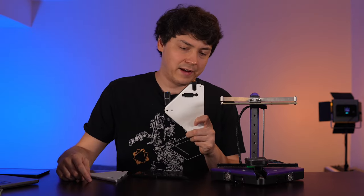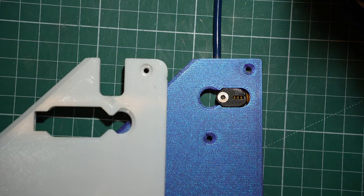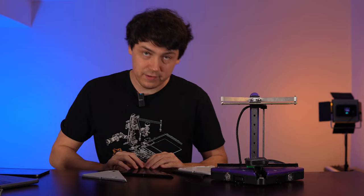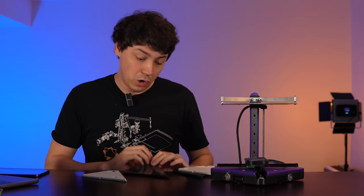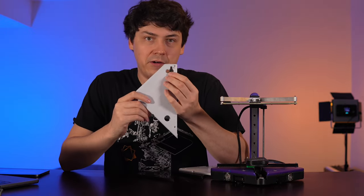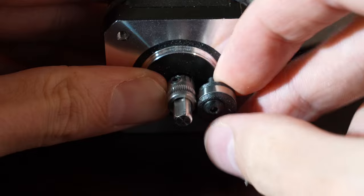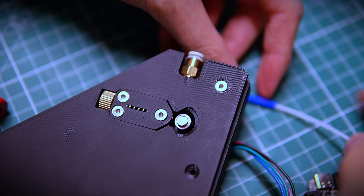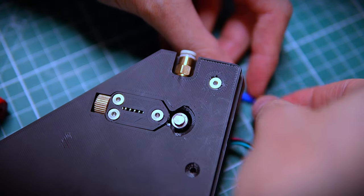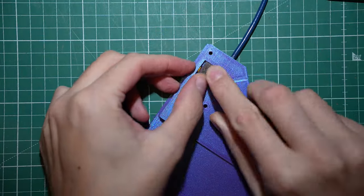Well, there was still a fight I had to win. I had extended the top plates to account for wire channels, which meant I also had to move the extruder from the left of the motor shaft to the right side, where there was almost no space. I made a lever-inspired design which looked sexy, but it held tension like 3mm of plastic — this design would only work in metal. I was particularly proud of one revision that used an eccentric cam inside the bearing to make the lever arm super compact. I made a hole in the motor and tapped it, and that stripped out. It was clear I needed to learn something from the original design. Pointing the spring at the shaft puts the extruder in compression, which is the best. I just redesigned the old tensioner with a smaller bearing and now I feel like a real engineer.